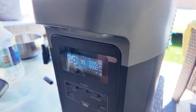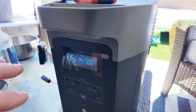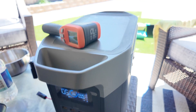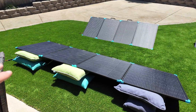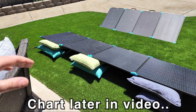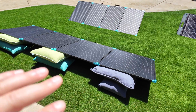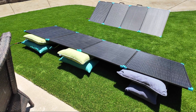The numbers we are seeing now are in the middle 330s. I did see a 343 for a couple seconds that went back down to 335. So about the max of what we're getting on this test. It's about 90 degrees and the temperatures of these panels are super hot. If you wanted to calculate temperature coefficient numbers, we would probably be accurate as far as our output in this test. It's a certain percentage drop for every degree above 77 degrees, and there's a whole formula on it if you really wanted to read up on that.